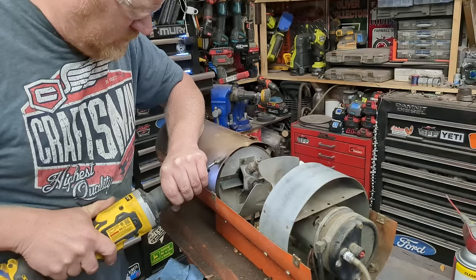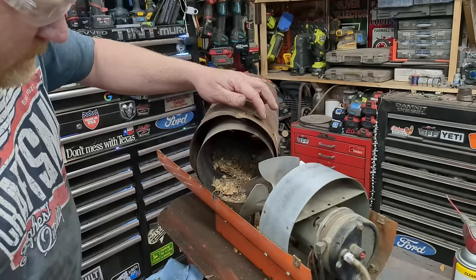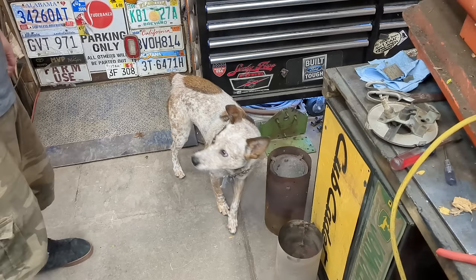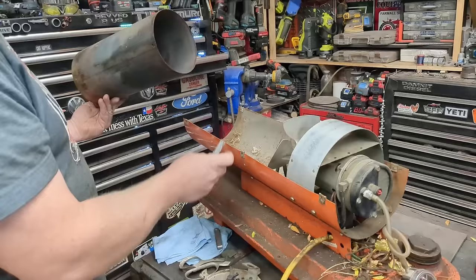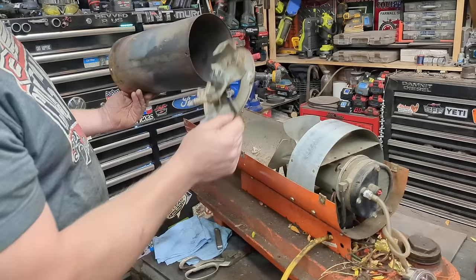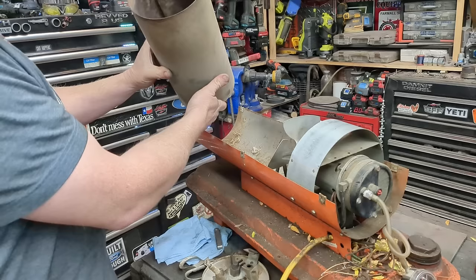At the back it's filled up a good third of the way. We'll take these rivets off and re-rivet it or just put a spot weld right there. It looks like this back case just prizes right out. Apparently the mouse needed some reading material — this was tucked in there with it. They actually pulled this metal piece off the side of the transformer and dragged it through that hole. The inside is actually stainless steel, so it won't rust out.